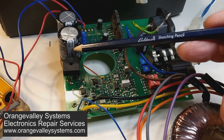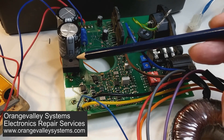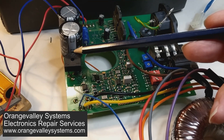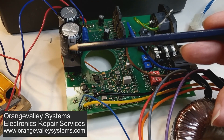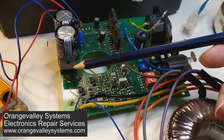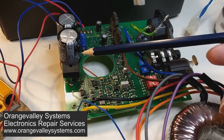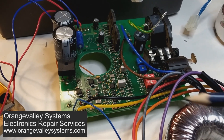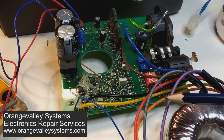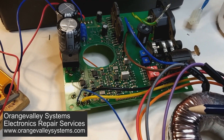You wouldn't normally expect to find a capacitor running at its maximum rated voltage, so probably looking at around 30 volts running on this particular unit. Buying an off-the-shelf transformer is always tricky because they tend to come in voltages that aren't quite what you need. The ones I've looked at were either two 18-volt windings or two 25-volt windings.